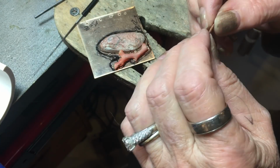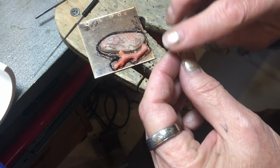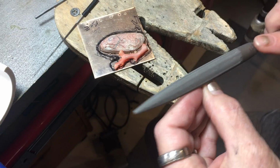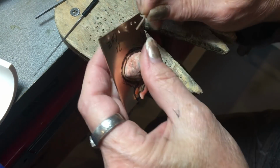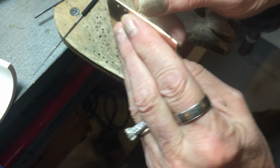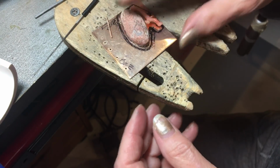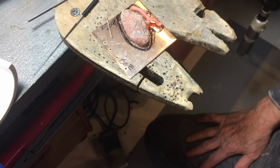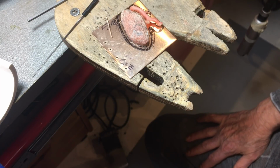Also, a lot of times when we clip these, we get burrs on the end of them, so taking those burrs off sometimes is all that needs to be done. Just make sure that I don't have any here. Oh, this one needs to be worked. It's almost there though. I can actually see it staying in, so a couple more swipes with my round nose escapement file will probably have that working. So those are my methods for working with your drill bits and opening up holes.